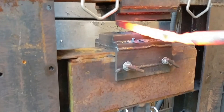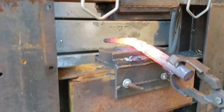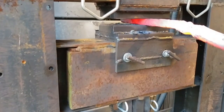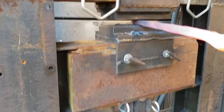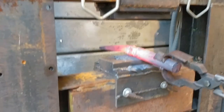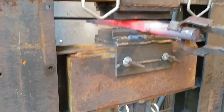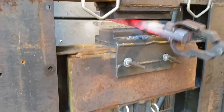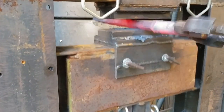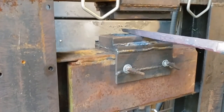You don't have a lot of control as far as variability of the pressure with a press. One thing you'll notice is that a press makes a really great tool if you are resizing material, and I use my press a lot for that operation. A press is great if you want to put some kiss blocks in — say you have one inch round and you want three quarter inch square bar, you can press that pretty quick and easy. Whereas with kiss blocks on a power hammer it's doable, but you can't obtain the same degree of accuracy that you can with a press.